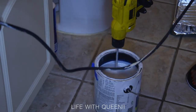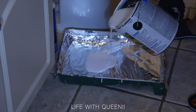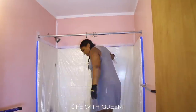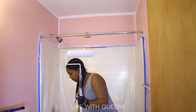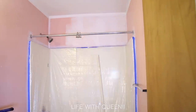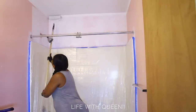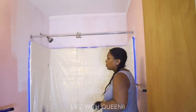To start, I'm going to be using the Zinsser no-sand primer — really really awesome stuff. I'll cut my edges and corners first with a hand brush, then go in with my paint roller. You just want a nice thin layer on the wall. The reason I primed is because I really dislike this pink peach color — I wanted to make sure none of it was visible through the new beautiful gray shade. I also used this primer on the ceiling, which had a very dingy white look.